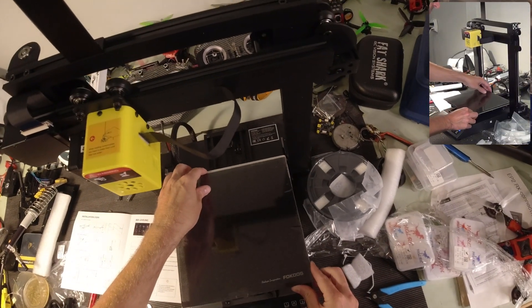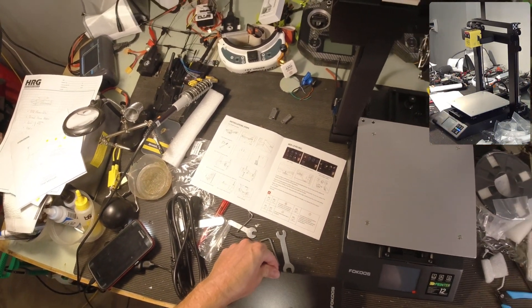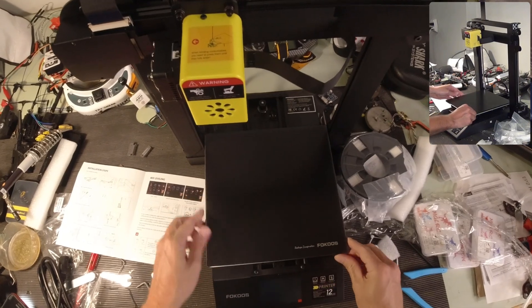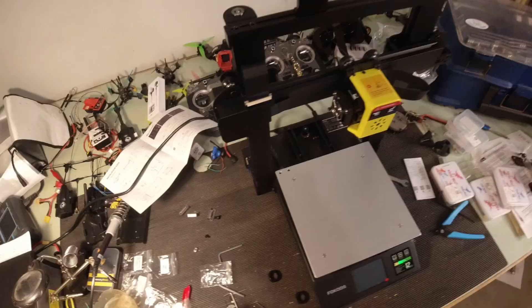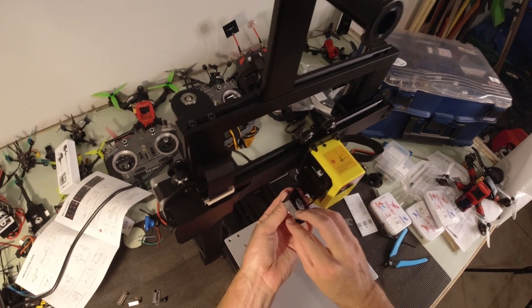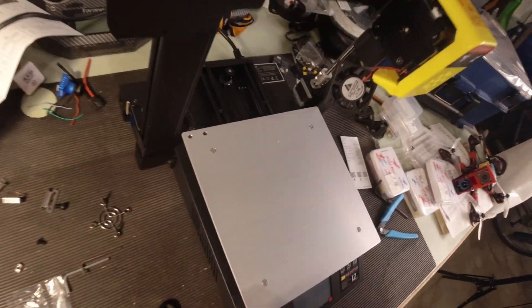I'm pulling on it pretty tight, but still — this would screw up a bed leveling like crazy. Now what I've heard with these is you don't want to fingerprint the plate a lot, so just keep a light touch on it. If you angle from the top and rotate them down, they don't scratch the bed. The other thing I've read is you want to tighten up the hot end on this. To do that, we're going to take off this fan — you shouldn't have to do this, but people were having some trouble, so we might as well do it.